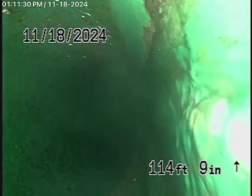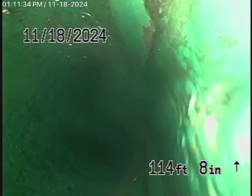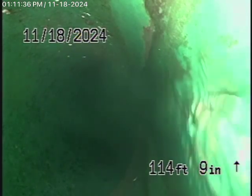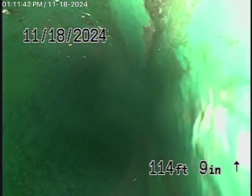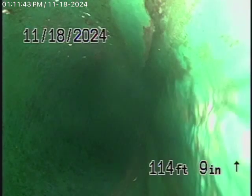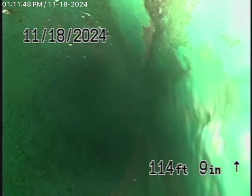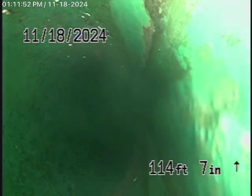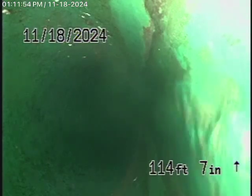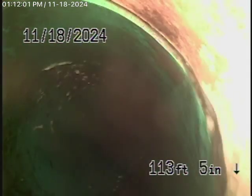The house is on a concrete slab, and we're actually running our camera from a 3-inch end-of-line clean-out. There is a clean-out also where the pipe exits the house. We've gone into the line like 115 feet — we're way into the sewer line. This is probably under a homeowners association, and we're in an SDR35 sewer pipe. It looks like a 6-inch pipe.